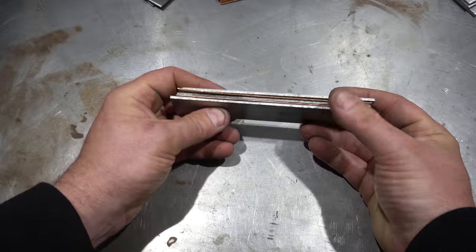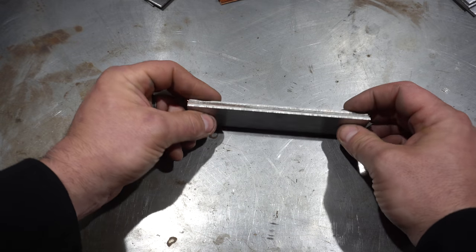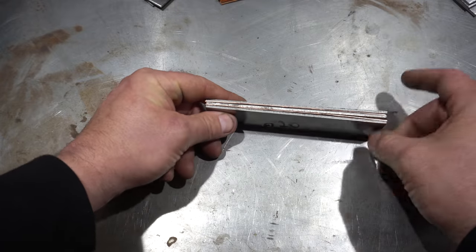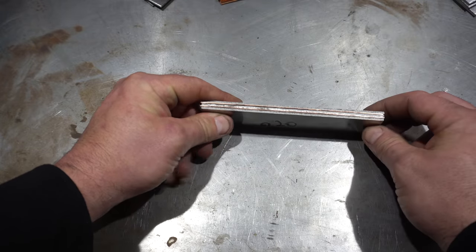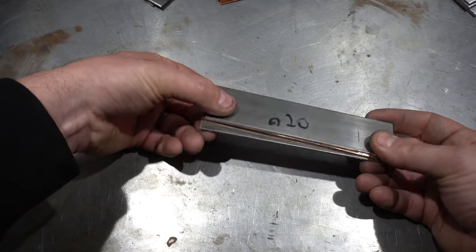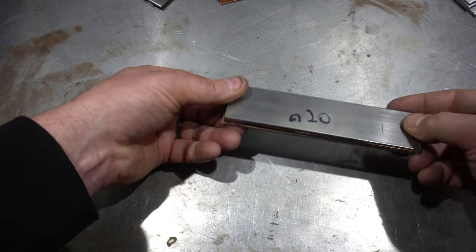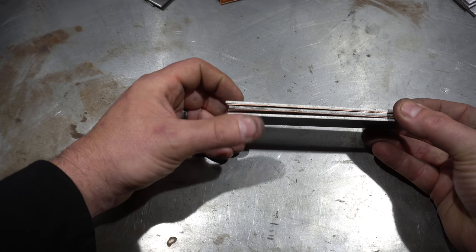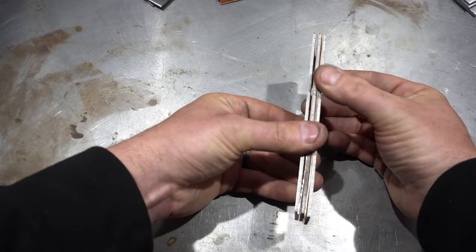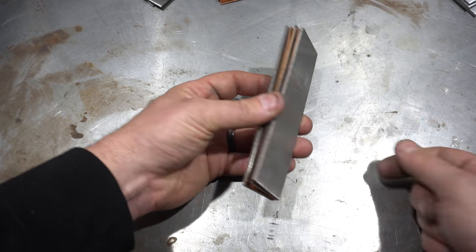Even though you're going to keep this below 1,800 degrees, to give yourself some insurance you're going to want to weld all of the seams. People say welding contaminates it — don't worry about it, you're going to be grinding this all off anyway. Weld all of the seams to keep the copper completely encased. This is actually a recommendation for all san mai builds: always weld all of the outside and keep a completely oxygen-free center. I always do that for all my layered san mai constructions — it's just insurance and it works well. So I'm going to take this over to the MIG welder. I've already cleaned all the surfaces and we are going to weld this up.